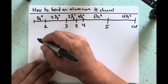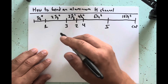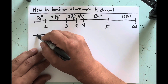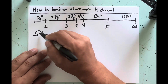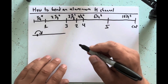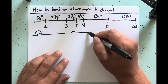First, place the metal in your brake with all your marks facing up. Clamp it on that seven eighths mark and bend it 180 degrees — that's a hem. You'll see in the video how I go about making that hem nice and tight. After you're done bending, it'll look like a flat folded edge.